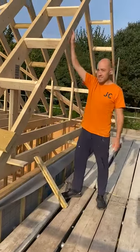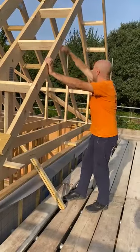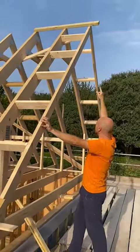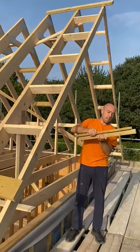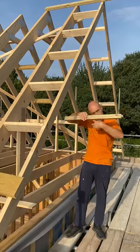Good work tips when doing ladders. If you're working in a pair, it's easy enough to have somebody at the top and put a piece of timber at the top to get your line of the ridgeline and to fix down. If I was doing this on my own, I would get two pieces of timber, plant and saw like that, and put that on top because that would give me the ridgeline straight across.